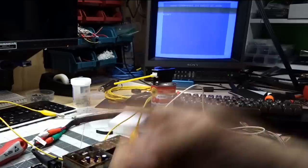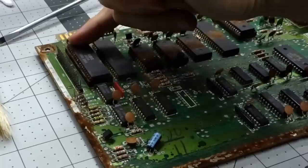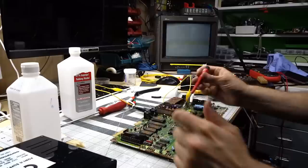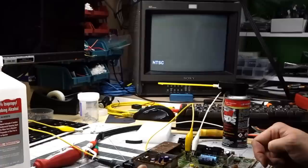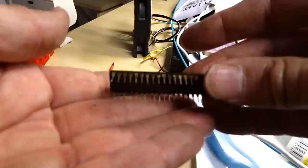I think — people can correct me if I'm wrong — but this is the 6526A? That's a socketed chip on this board. The rust on the pins is probably preventing it from making contact. So I'm going to yank that and spray deoxidant in there, put that rusty chip back in, and see if that fixes it. I just used deoxidant and kind of pulled it out of the socket a little bit and pushed it back in, but still nothing. So let me yank it out completely. That is one rough chip.